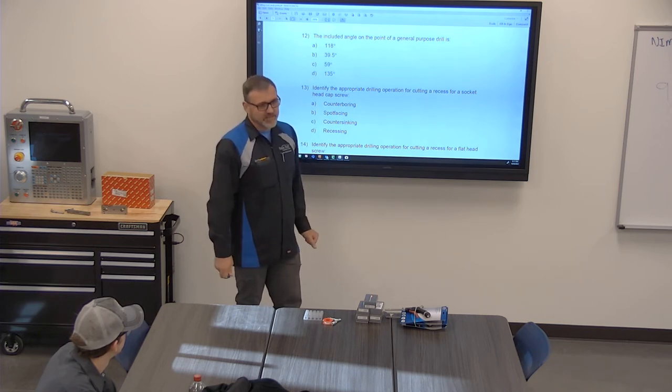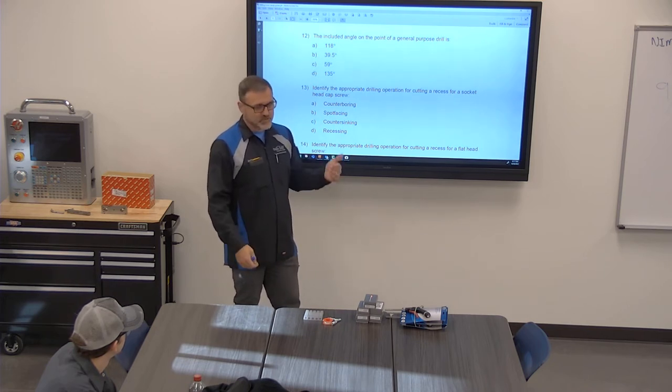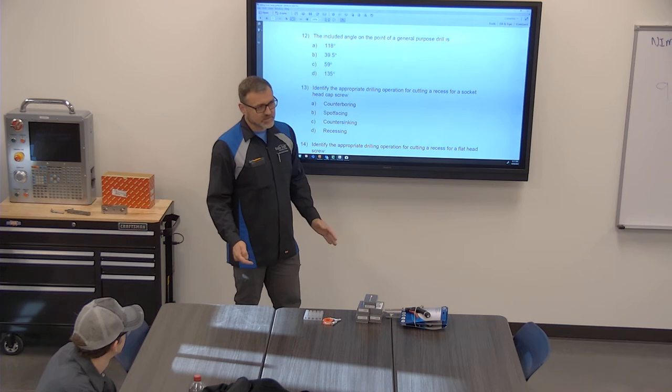If that were to happen to me today, I would back off and develop some kind of procedure to make sure you had the steps in place to check chuck pressure before you move on to the next thing. Don't allow parts to stick out the back of the chuck, those kinds of things. You've got to put some safeguards in place.